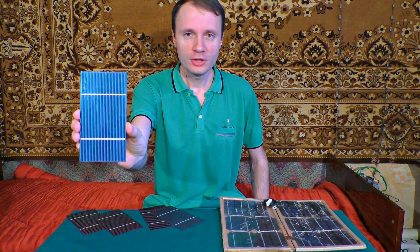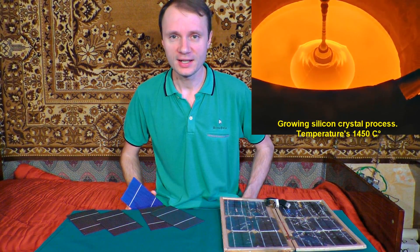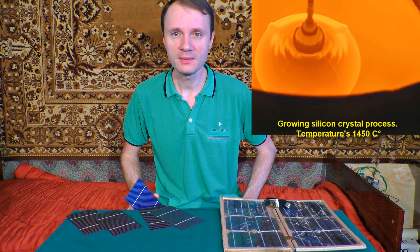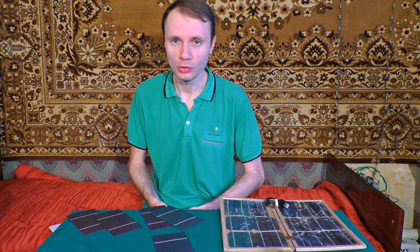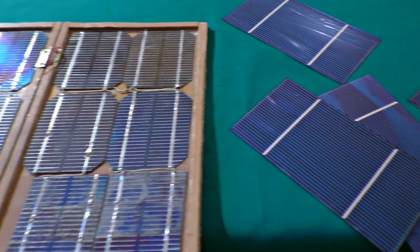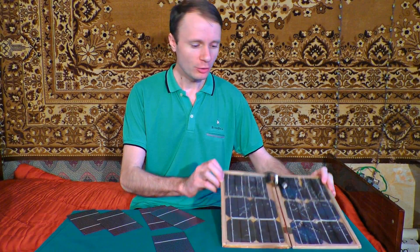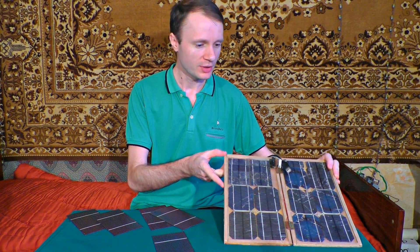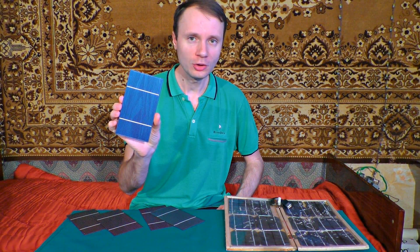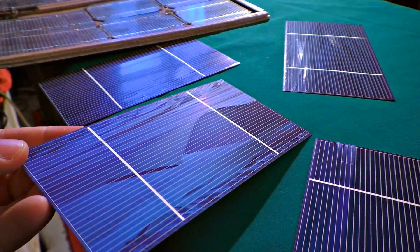The main elements we need are the solar cells. As far as the DIY of real silicon crystals is quite costly, I recommend you to buy a ready-made one. They don't cost a fortune. We are going to need 12 modules. Size doesn't matter at all — choose any. The larger the cells, the more power they produce. For example, solar cells like these generate 1 Ampere, perfect for one device charging. These batteries provide 4 Ampere's power, ideal if you want to charge 2 or 3 devices simultaneously.